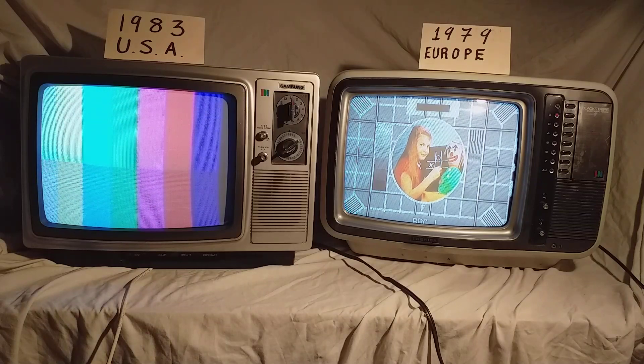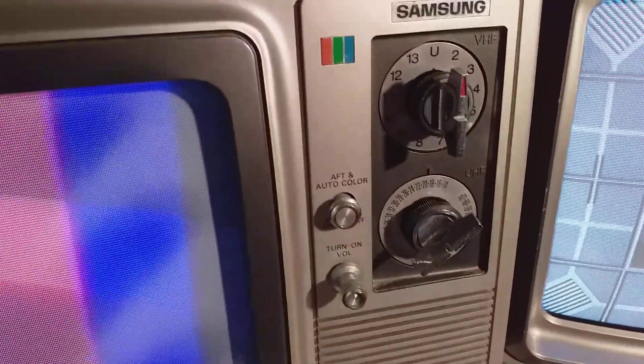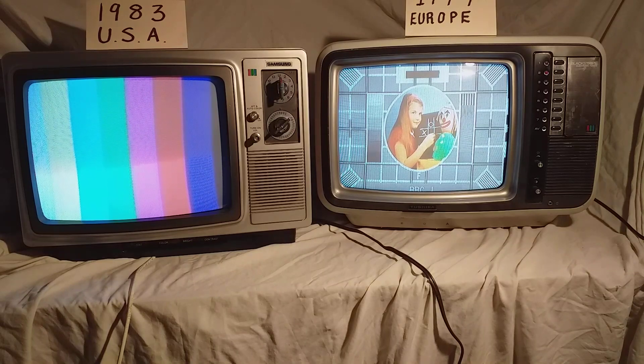But the story was different in America because they had commercial broadcasters, so they had an awful lot of stations. It would be very hard to make a television with a mechanical preset tuner with say 100 buttons down the side of the set, and the technology wasn't available at the time for IC memory to do 80 or 100 channel presets. So the easiest thing was to have a mechanical tuner — that's why American sets kept mechanical tuners much longer. You have the VHF tuner on top and the UHF one on the bottom, it's detented, the channels are marked on it, and there's fine tuning as well.